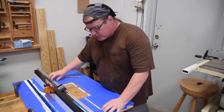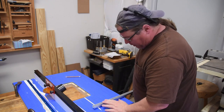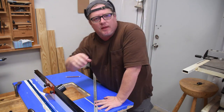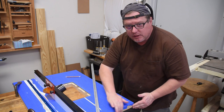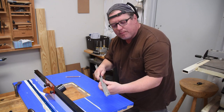So our question comes, do we want to put these grooves so that they come all the way back off the backside? That way, whenever we want to slide the pins in, we just kind of come in the backside. That'd probably be the easiest thing to do, and it would let us experiment with using a router with a guide maybe on the side, because we've got these parallel. It just comes straight in with a router bit this size.